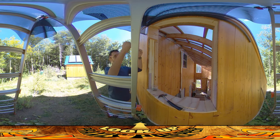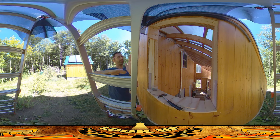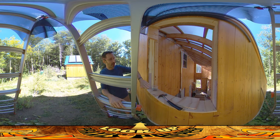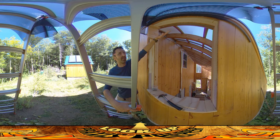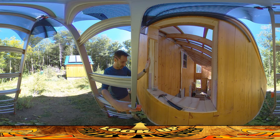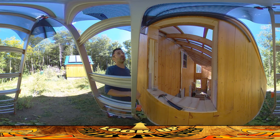It's going to be the same shape as a window — like a frame, the same shape as that. It's kind of a quadrilateral shape, and it's going to have louvers coming down from the top. The point of that is that you won't be able to just look straight down in there, and it'll make it so that when rain comes down, rain will shed off to the outside instead of just blowing right in and making these sills all wet.